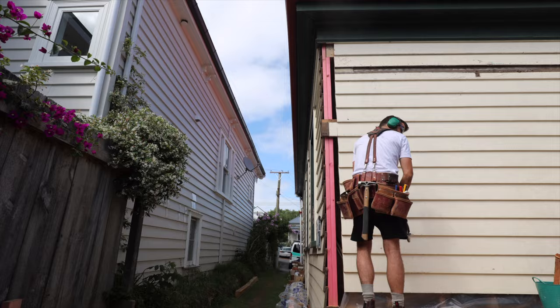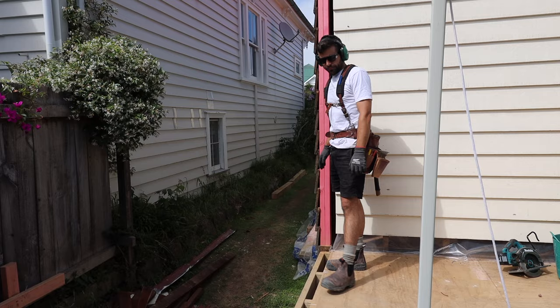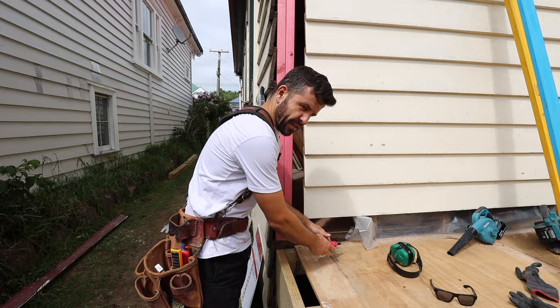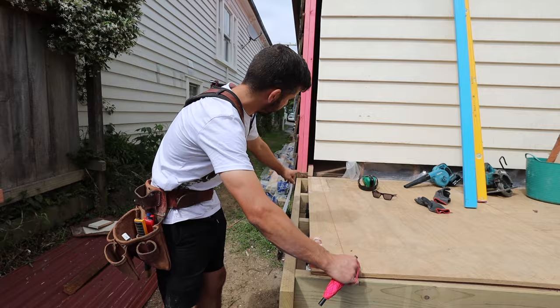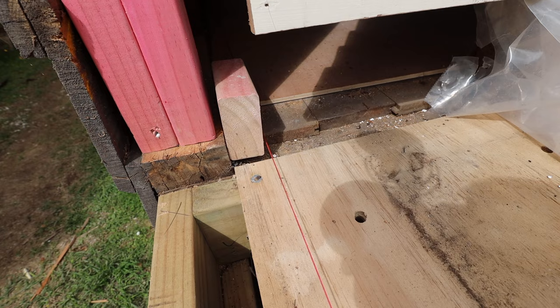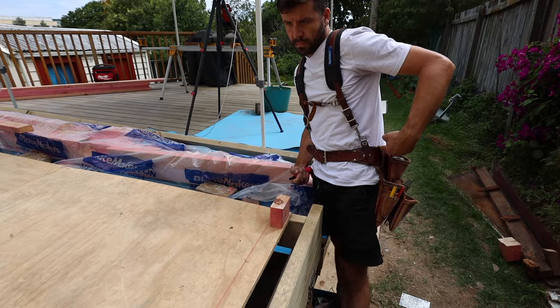It was the other day that we started laying this out. We're cutting that channel on the wall because we want to frame the new extension and it starts from here. Now that we have this channel cut out, we can project the wall out here. We've got dodger blocks out there, we've got one of these nailed at the other end so the line is that thick away from the wall frame, and we've got another block in the middle. The idea is you pull it tight until it touches the block there - that's roughly where we are.